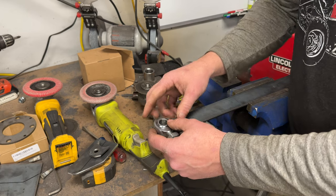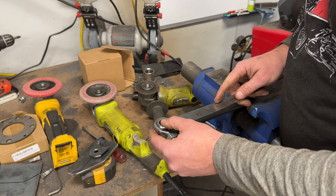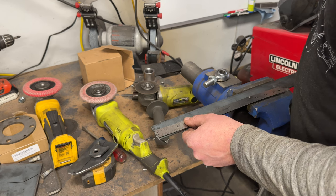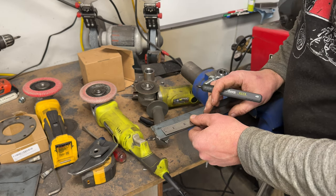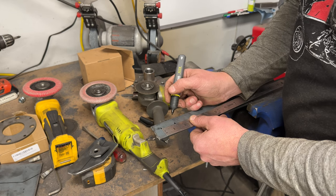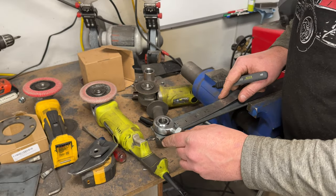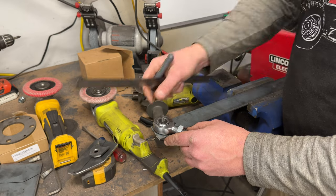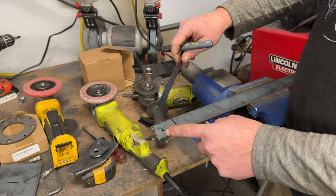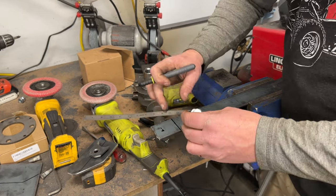for travel, for movement, whatever you wanna call it. And I've measured that at 1 1/4 inches from the center of the hole. So I'm gonna come in my usual 5/8 to the center of the hole, and then I'm gonna go 1 1/4 inches to the base is what I came up with. And I'm gonna visually verify that that's gonna be enough clearance. Yeah, that's gonna give me plenty of angle. Yep, so I'm gonna make 2 of these per side, and then just this flat piece to box it.